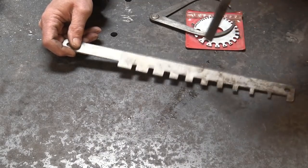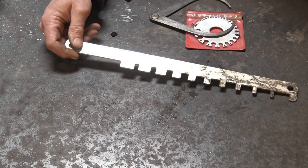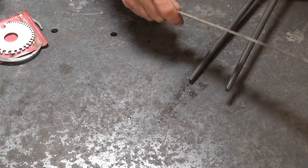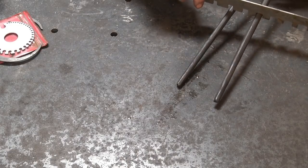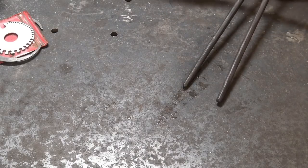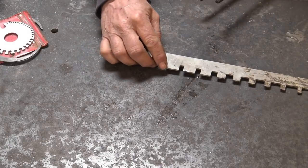If you want to know if that's 1/2 inch, you can measure it there. And if you're working at the forge, this is very handy as you size stock down. For instance, the other day we were making tongs. You can use this to check the reins and see if you forged those down evenly, or if you want to taper, you know where the size changes. You can compare one to the other quite easily and get very accurate measurements.